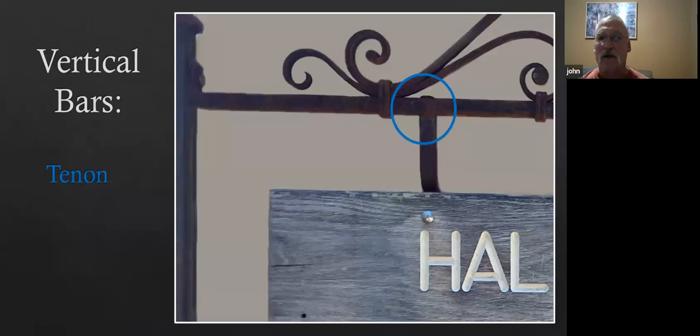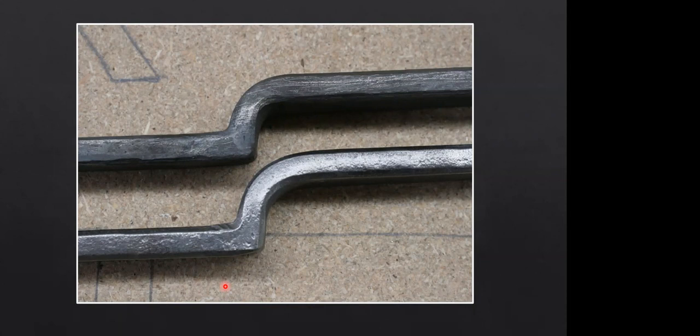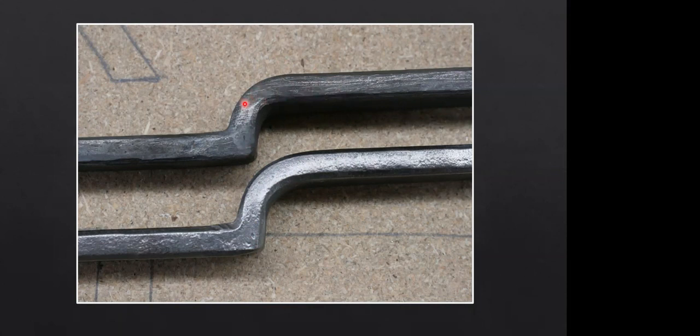You can see the center punch marks on there for the square corner — they came out pretty close. The one I was wanting is the one on top, which was tight to the jig. The bottom one has a curve that's too big. Either one is fine as long as they're all the same. You wouldn't want to put those two together — if you had the sharp bend at one end of this bar and the bigger bend at the other, now the sign is not going to be parallel.